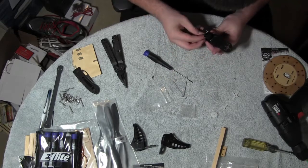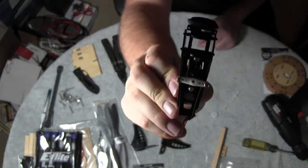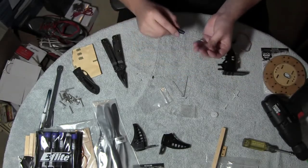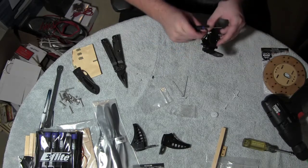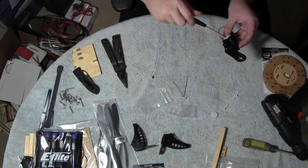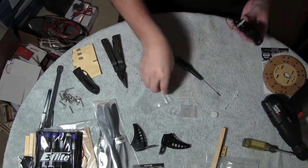And next, just gonna pop the servo horn on, make sure it's nice at a 90-degree angle to everything else. The servo horn is what I'm talking about. And you're gonna take that screw that comes with the servo and hopefully not drop it. Basically, again, there's a center hole in the servo horn, and you're going to go and screw that on. There you go. That does sound like a digital servo.